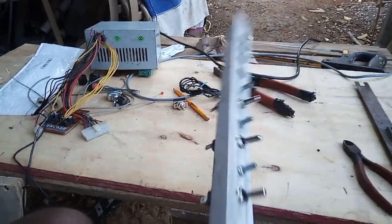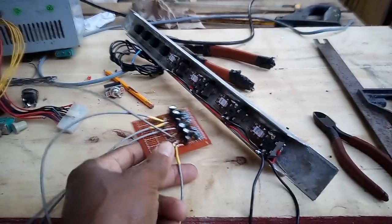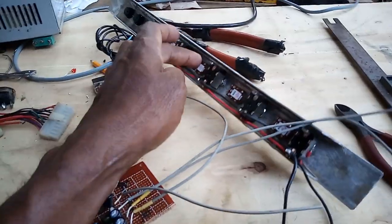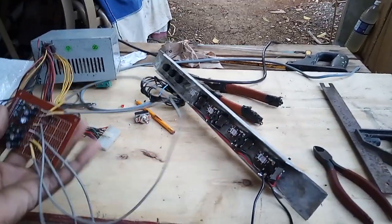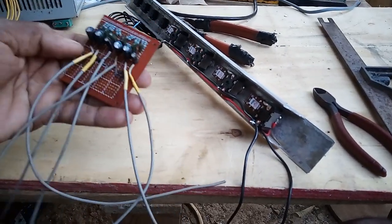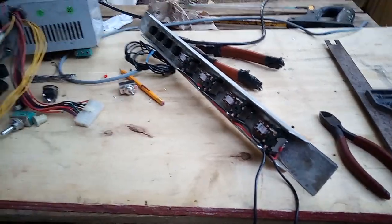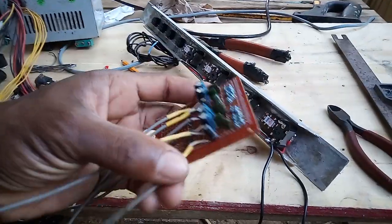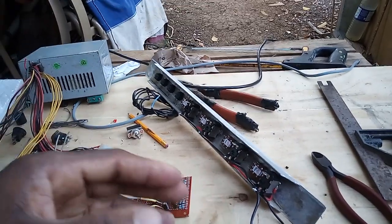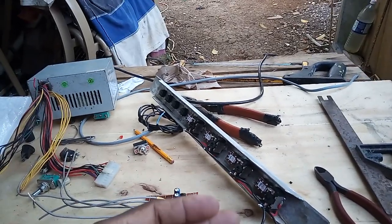So it's all about now for me to put in my board and get all my wires soldered up to hold the volume inside here. And then I'm going to put in all my jacks, because I'm just going to solder in the jack here that is going to go to the amplifiers, and the jack that is going to come from the drive rack. So this circuit is just a separation, just for me to turn down the mid or the horn or the bass or the tweeter if I want to. You understand? I don't want to go to the amplifier to do that.